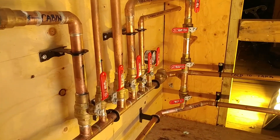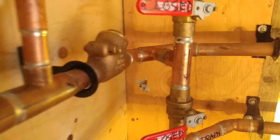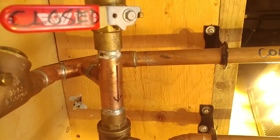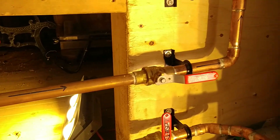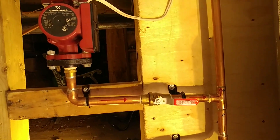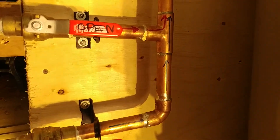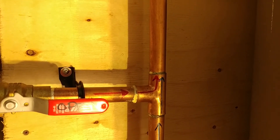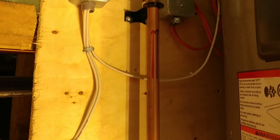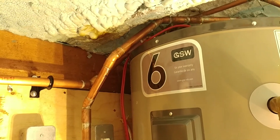Following the water around, we go through the check valve. This is a drainage point. We have our cold to the hot water tank. The recirculation pump joins the flow here, returning the hot water that's been circulated around the cottage back to the tank for a reheat. There it goes in the top.